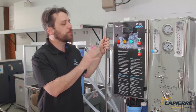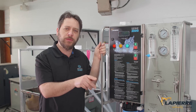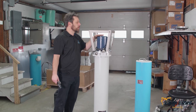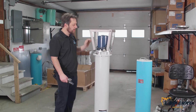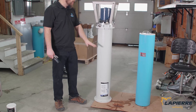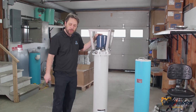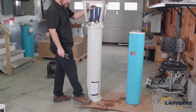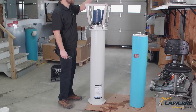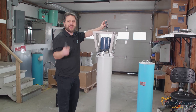Just a quick inspection. Now we're going to get ready to put the membrane in the vessel. Before that, I want you to make sure that the vessel is not stuck and the bearings are okay. The proper way to store a high pressure membrane vessel like this would be upside down to make sure it drains properly and that the motor is away from the ground, away from any humidity. I'd rather have it on a small piece of wood so air can go under it. Before we put the membrane in, make sure the motor spins freely so there is no bearing issue and the seal is not stuck.